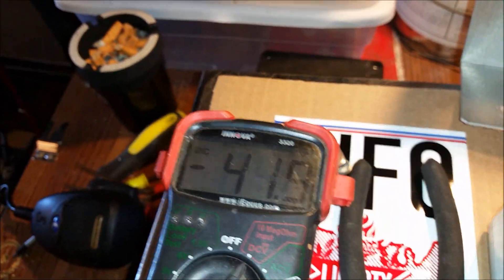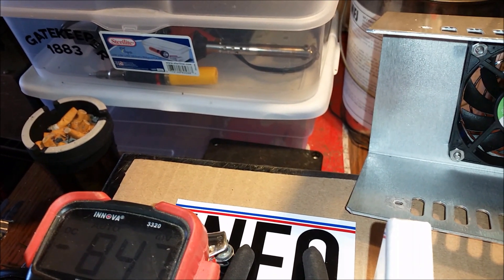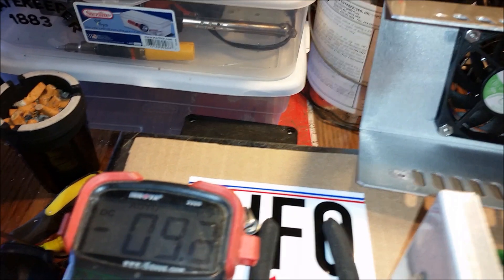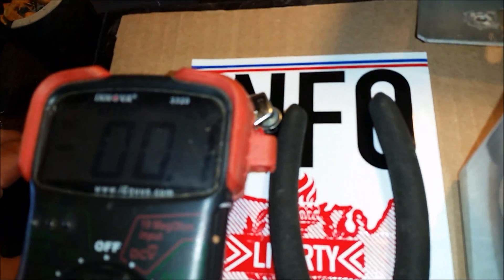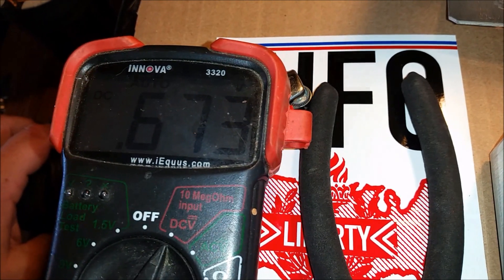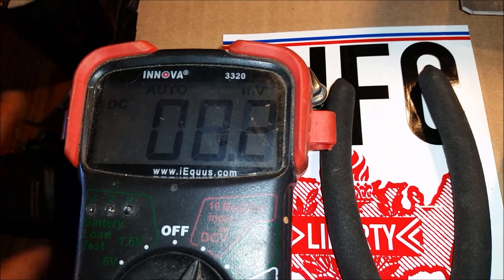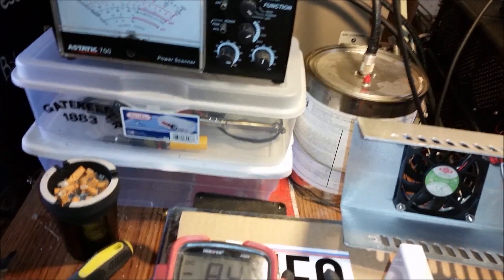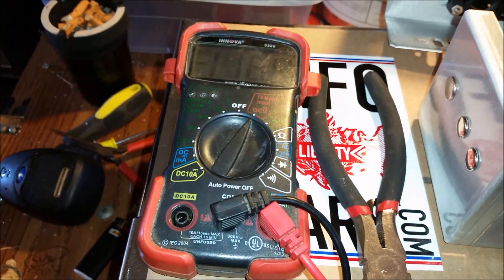Now as you see, this is non-regulated. I'm going to turn it down to about 14.5. Now we're a lot safer — 0.67, 0.68. I'd like to run this around 14 to 14.5, which is a great spot. At 15.3 volts you're at a dead even 0.7 — that transistor is all the way on. After that you're in the red zone, and I don't recommend running it past that at all.